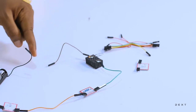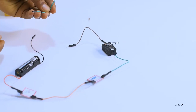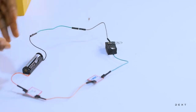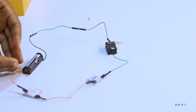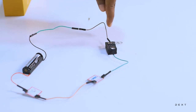Then we can connect the switch to the resistor. And then finally, to make this final connection, we can either connect the battery directly, but I would prefer we use a female-to-female wire to connect these two male wires together. We have completed our circuit. We have the LED connected to our battery. The positive side of the battery is connected to the positive side of the LED. We can tell which one is the positive side of the LED by looking at the circuit symbol and seeing the direction the arrow is pointing in.